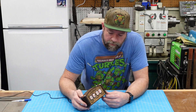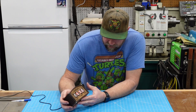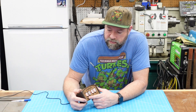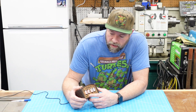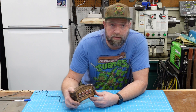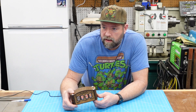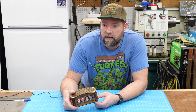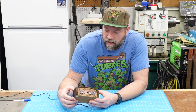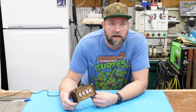So this is a kit that I picked up — it's out of Ukraine. It uses real Nixie tubes. If you don't know what a Nixie tube is, it's kind of like a little neon tube, but it's used for displaying digital information such as numbers or words depending on the design. There's basically a wire mesh in there that acts as a cathode — it's a cold cathode display used for displaying information using glow discharge. It's filled with gases including neon, possibly mercury, and argon. So it works very similar to a neon tube.